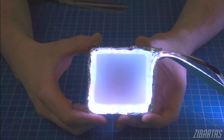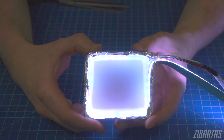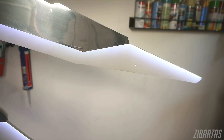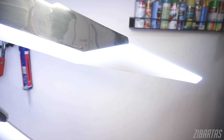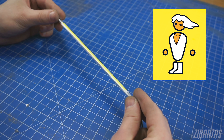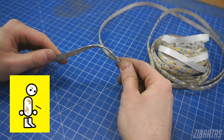If you've seen my LED basics video, you'll probably recognize I'm using the edge lighting technique for the wings. This is when you attach the LEDs to the edge and not the bottom of the surface you want to illuminate — this ensures a better spread of light. The reason the wings get so bright is because I'm using chip-on-board LEDs, not some casual LED tape.